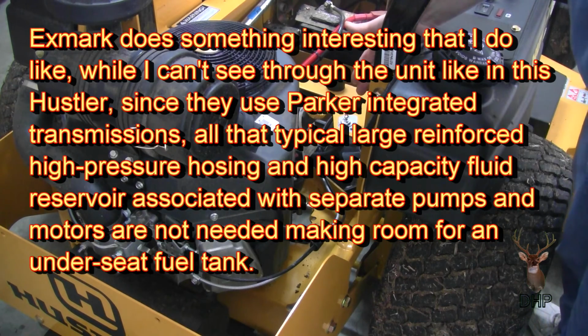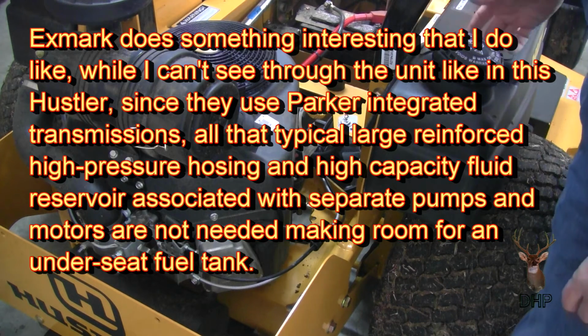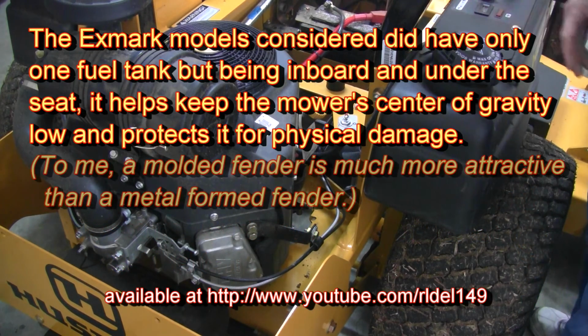As I mentioned, the fuel switch, left tank, right tank, is here. Again, the Ferris 2100 did not have a fuel switch. It just teed in together. It saved a little bit of money. To me, again, if you puncture a tank, this is a way you can run off the other.